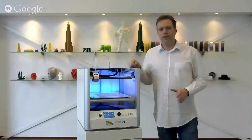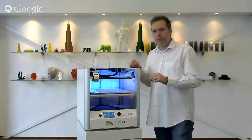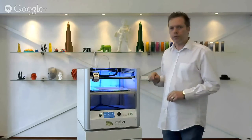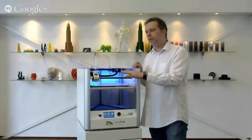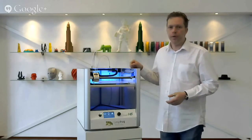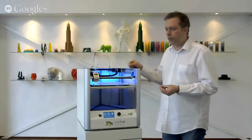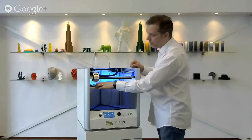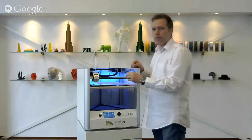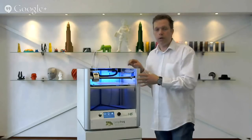The only problem is that after homing, the bed will drop down a little. That's because if you heat up, the extruders will be touching your bed, and that way you can either damage your bed, or heating up doesn't work as properly because the heat is going into your bed. So now it drops down and there's a little gap, so make sure that is not touching your nozzles. Only problem is that now calibration is hard.